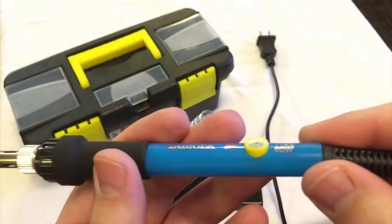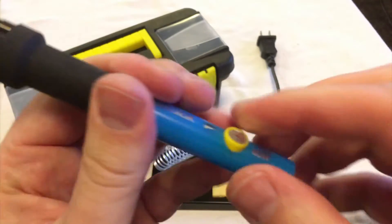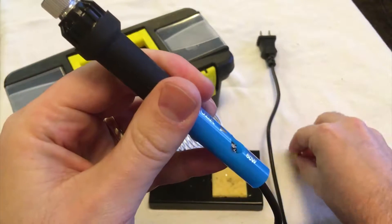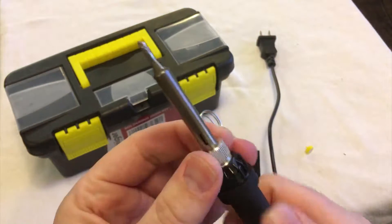So if something goes wrong, you've got the full 120 volts, 20 amps of your wall outlet. I'm going to pull off the rubber stopper and remove this little tab to the variable resistor — the potentiometer — and then undo this.